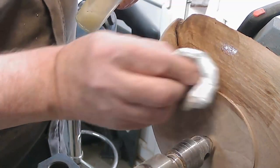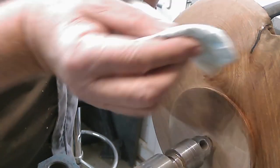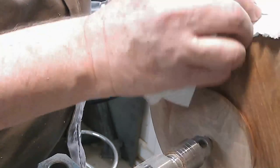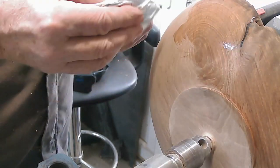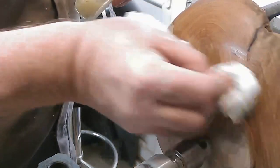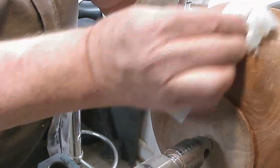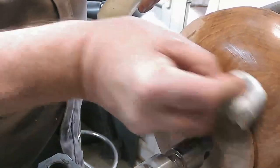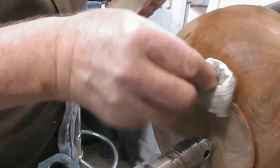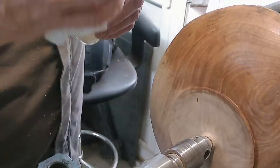The danger of doing several coats is that it starts to streak, as the top layer isn't absorbed fully in. But with wood this dry you need to get it into the grain, otherwise you won't get a decent finish. The alternative of course is to use oils, which is probably what I should have done as it's a walnut bowl. But my normal finish is a cellulose sanding sealer and then a wax.